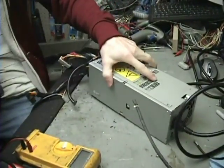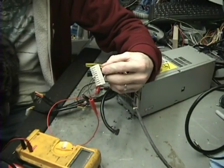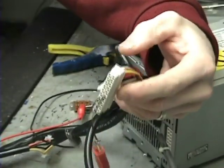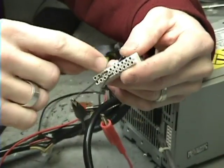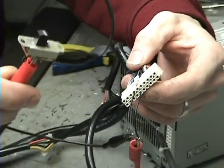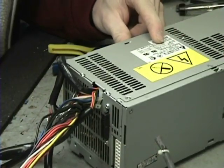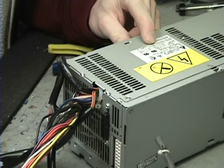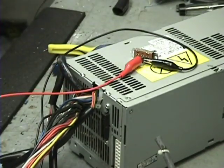What I've done here is literally taken two jumpers — you can cut the ends off, which would probably be a lot better. But what I did is I took pin 14, which on this one is purple, and a ground, and I just hooked it up to a switch. That's it. Now this is my on/off switch for this power supply. This power supply is pretty big — it will put out 5 volt at 42 amps, 12 volt at 8 amps, and 3.3 volt at 18 amps. This is a monster supply; like I said, it came out of a server.